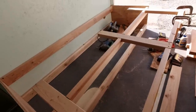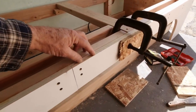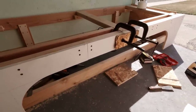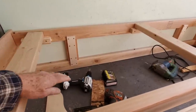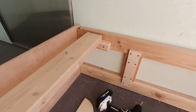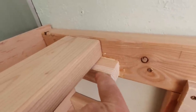We're not even halfway done building this, so we'll show you what we do as we go along. I installed this centerpiece here between the legs, just to finish off the trim and the leg on the front. I also installed supports in the back that go down and take the weight from the top all the way down to the floor so the bunk can't sag in the back. When the top of the bed closes, the ends of these 2x4s rest on top of these 2x2 blocks, and the very front edge is beveled a little bit just to make it slide up into there better.